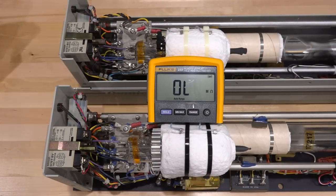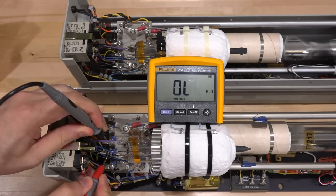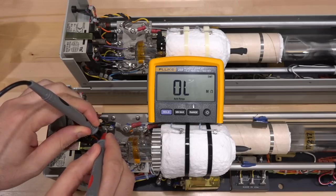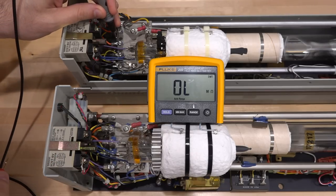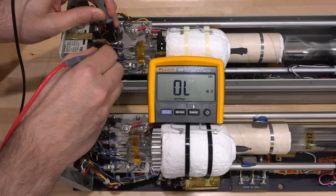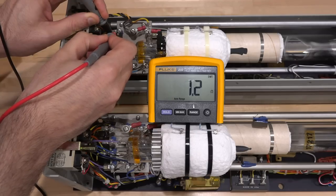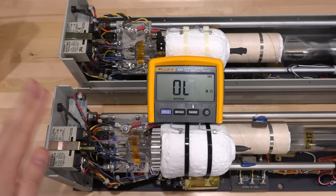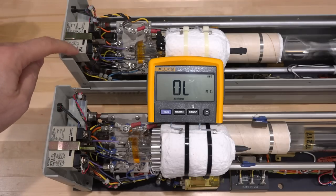Let's measure the filaments of the bad laser. Here's the spare filament — there's absolutely nothing there; we're looking for something less than two ohms. On the primary we're seeing 93 ohms, which is from the rest of the circuitry, not the filament itself. Now on the good laser head, measuring the spare — there it is, that's exactly what we want. And the one that's in circuit — there it is. So indeed both filaments on the good head are intact, which I'm quite happy about. The bad one is unfortunately not repairable since the filaments are inside the laser cavity.